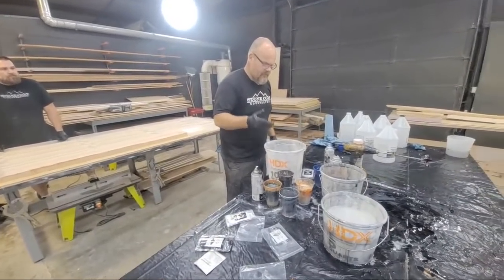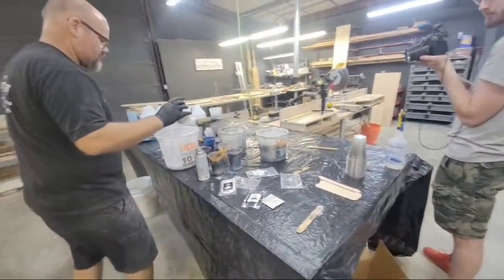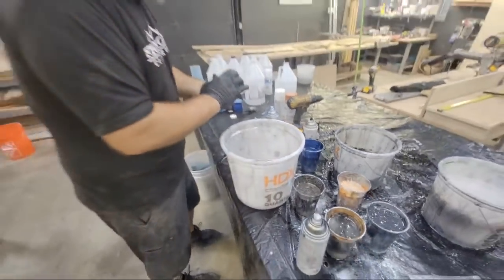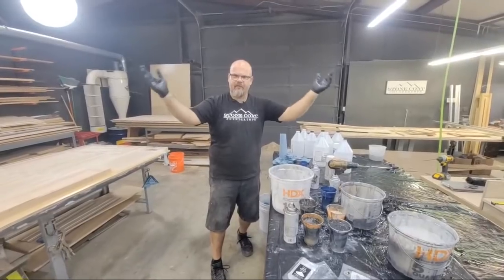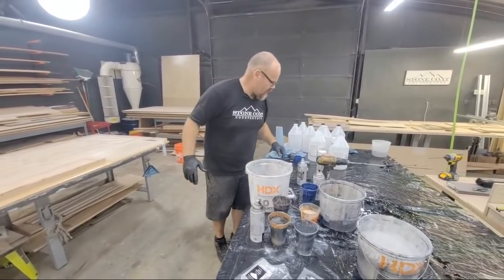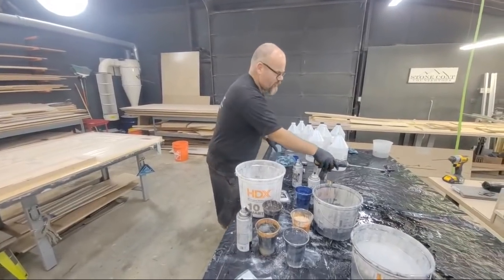I got this much epoxy left — is this the lighter part of the shower or the darker part? I think this is the lighter part, so we'll go lighter with more metallic powder and a little bit of white dye. So there's a lighter part and a dark part — we do the back panel first, half of it light and half of it dark. Then the return panels: we do one light, one dark to match. That really customizes the shower. It's a pro tip — that's how you get your shower to go from good to great. It looks like you planned it, because you did.